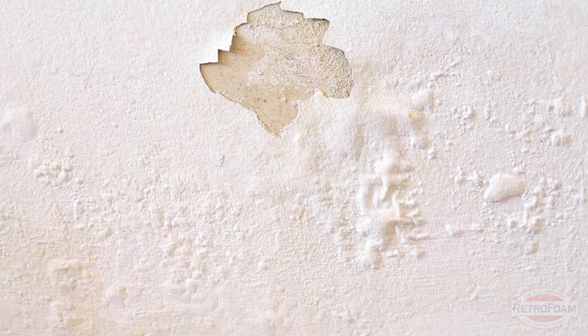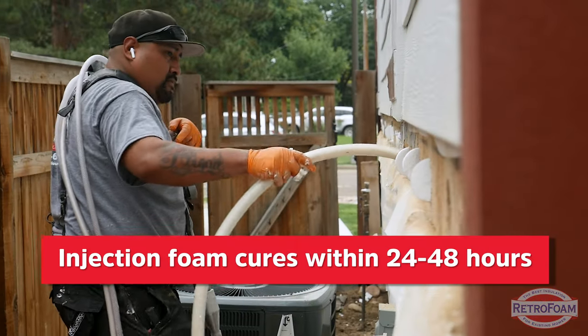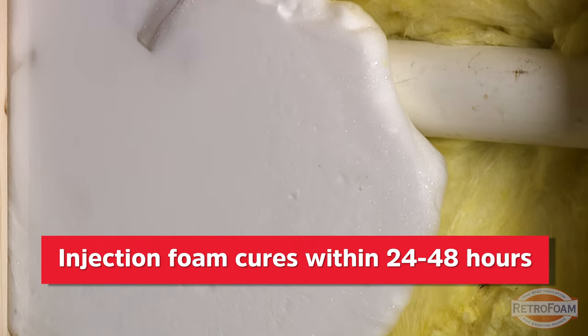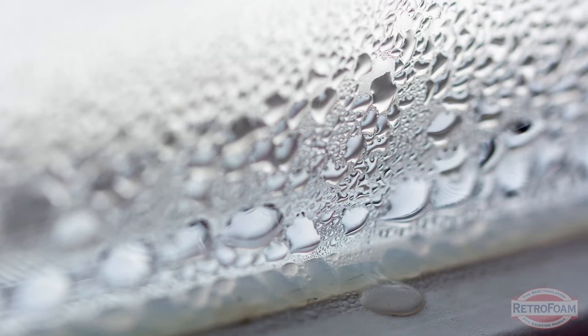Lastly, typically speaking, unless there's any sort of pre-existing condition — maybe a double vapor barrier or an already present moisture issue like a leak or some sort of penetration — barring any weird circumstances, there's really not enough moisture inside the product itself to cause major issues in the house. The product should cure in 24 to 48 hours as standard, and after that there should be no issues at all. This is again on an even playing field with no extenuating circumstances.